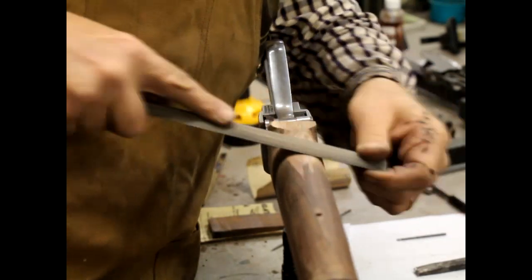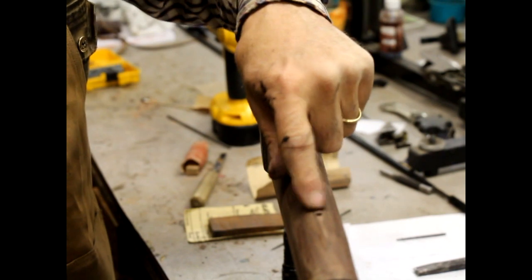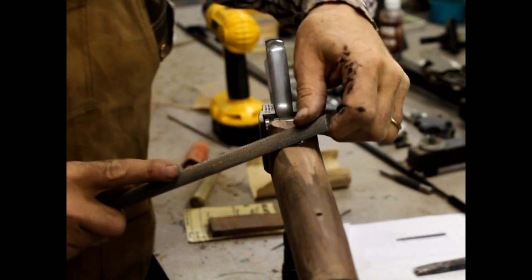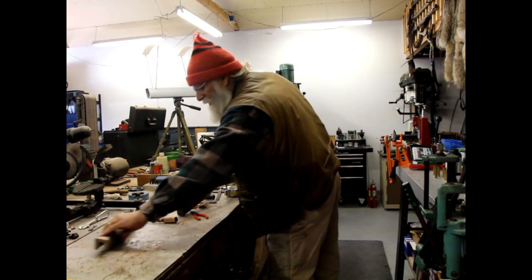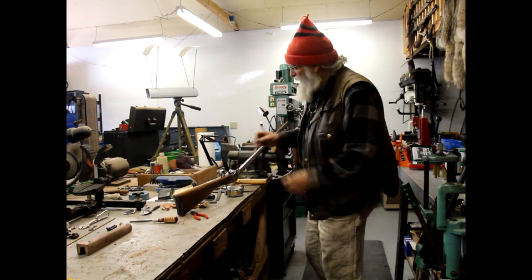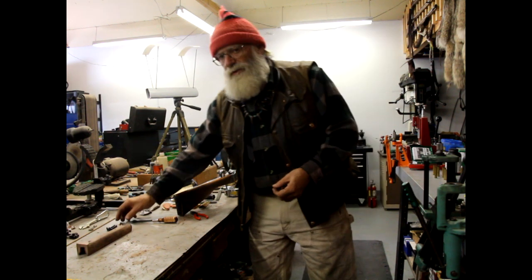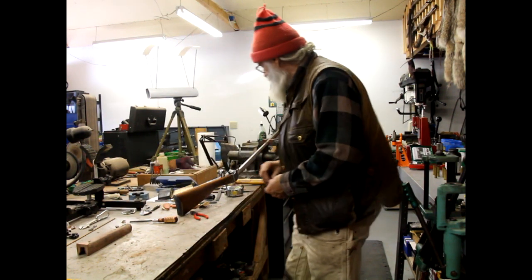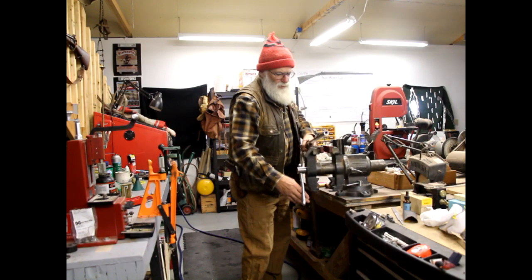It's just a splinter so there's plenty of wood here to come down. This all has to be shaped but I wanted to get it started in place because now that will tell me where this part has to go when I build that. So that's how we're going to put the screw down for the front end. I'm going to take that and dovetail that first. I need to work on that angle a little bit more but I'm going to dovetail that first. Then I've got to turn it over — I've got the front sight and the rear sight — I'm going to dovetail it and then I can put it together and it'll be in the white. But then I can start working loads.